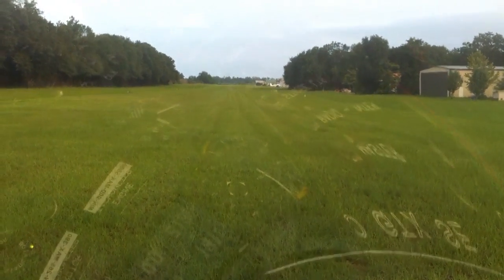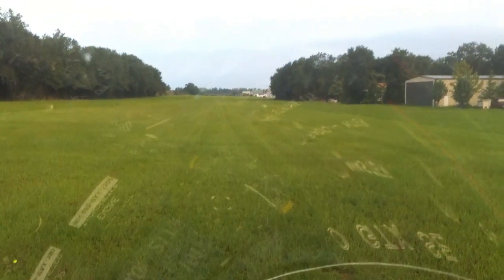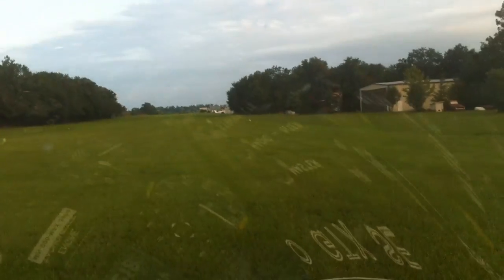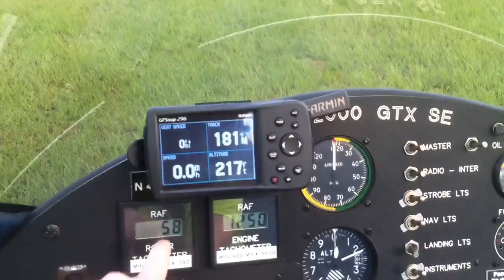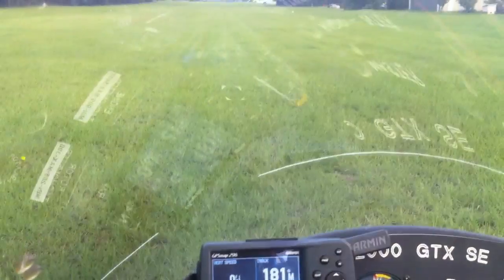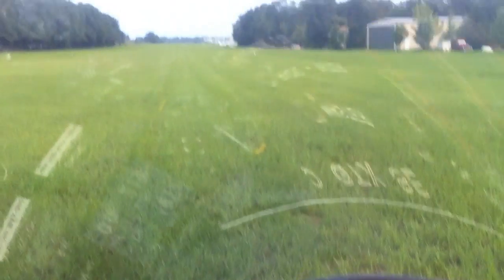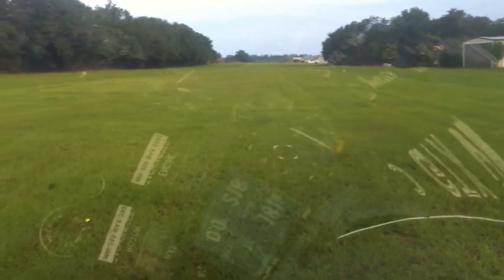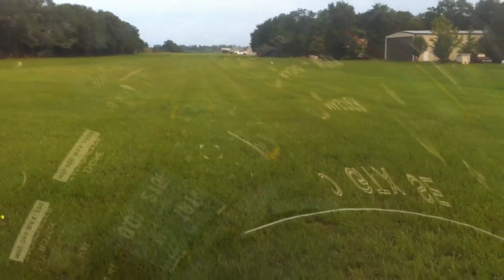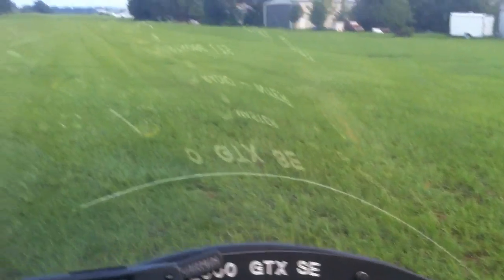Once we get some revolutions showing, we're going to want to get about 100 rotor RPM with the stick in the full forward position. We're going to start bringing it back beginning at 100. There we go — we're starting to register some. We've got almost 60. Got a really good solid squeeze on it right now. Not too bad of an engine drop. Tighter squeeze. Stick still forward. Everything still looks good in the cockpit.